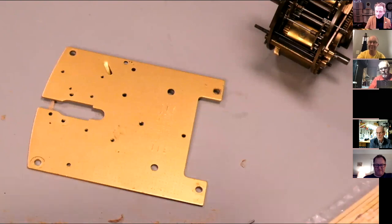But Wolf is absolutely right. And a lot of people really hate that steel wool thing. What I would say about it is that, of course, if you do that, particularly with new bushes, you've obviously got to clean out the hole afterwards. You don't just throw the clock together with the little fibres of steel wool in there. You peg it all out. And I've done that for years and always found it okay.